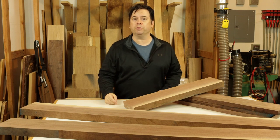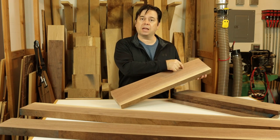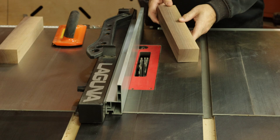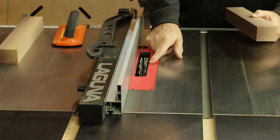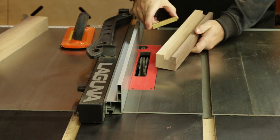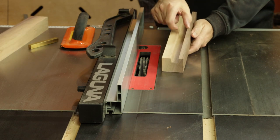With the panels dressed out at the drum sander, we can move forward with some of the joinery. We'll break out some of this thick eight-quarter walnut to make the four legs for the stereo rack. The joinery involves first cutting these parts to rough size, and then with the dado stack installed on the Fusion F2 table saw, we'll run a long groove down each piece and cut notches to receive the shelves. Make up a scrap of the same thickness eight-quarter stock for the legs and make sample cuts. The first cut is a long groove the full length of each leg — blade height is half-inch, and the spacing between the outer blade and the fence is also a half-inch. We'll run this test cut to have as a reference for future cuts, then widen it to a full inch to accept our side panels.